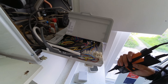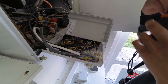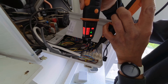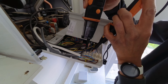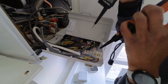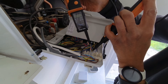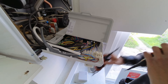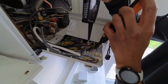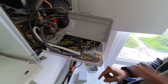I've had the power off and back on again to test the two terminals. I said one is 240V out and the other is switch live back in - the bottom one is 240V out and the top one is switch live back. Testing the two wires from the Hive - black one isn't live, gray one isn't live. That's because I've taken the receiver box off the back plate, so it's not sending any power. But we know what's what in the receiver, so let's make the adjustments and wire this back in properly.